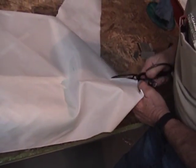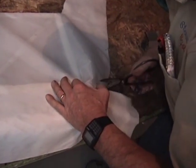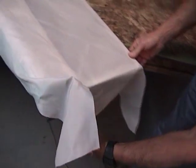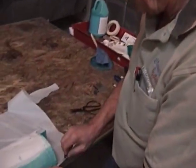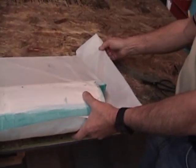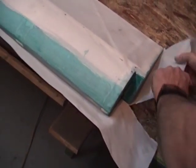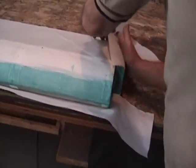I'm just going to go ahead and make a little cut across here, doing a chute for just about at that corner right there. Now we slide this off the end of the table and go ahead and make our tuck here. We went ahead and turned the aileron around — we've got the other end here yet that we can glue, so we'll go ahead and cut this across, tuck our piece up here, and lightly tack it into place.